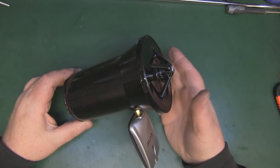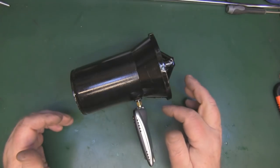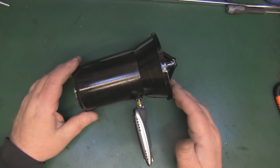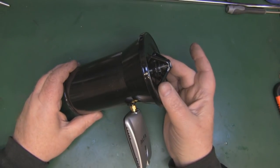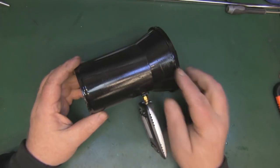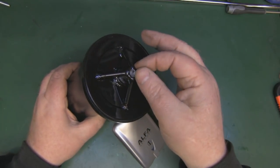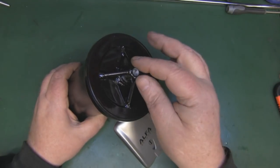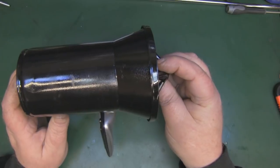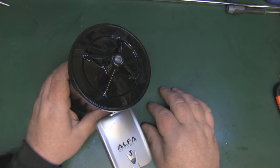Here's a close-up of the cantena feed point I've made for this project. It's a little bit shorter than normal - you've seen me make one of these horn-type cantenas on the channel previously, but you don't need a really long cantena when using it with a satellite dish because you're guiding all the waves into one small point. This one is about 74mm in diameter - a smooth can, which also helps - and I've put a horn rim on the top there. Because this is a plastic lid off a different can, there was a little bit of flex, so I used some straws epoxied in to give it more strength and covered it with some black gloss paint.